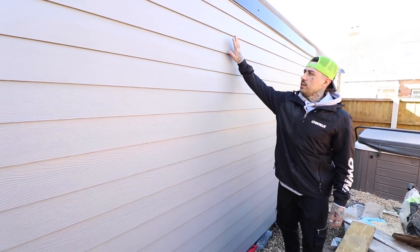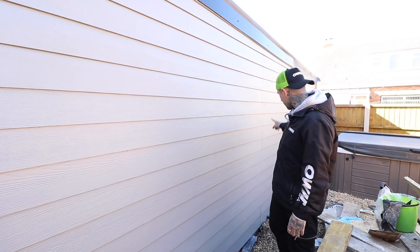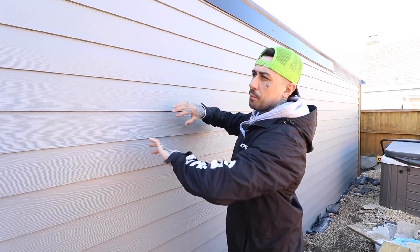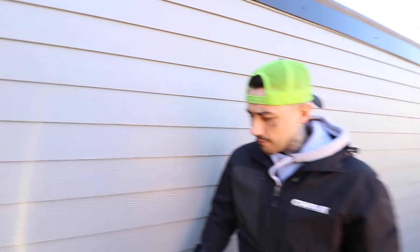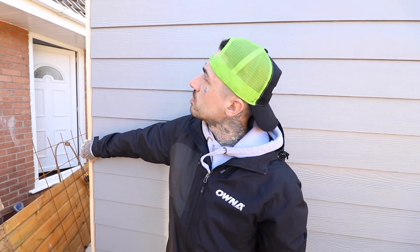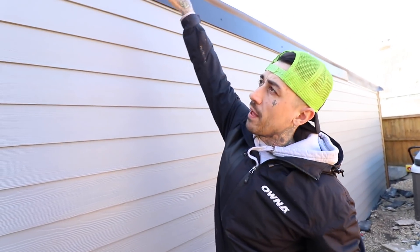So as you can see, the cladding's done and looks pretty sick. I've got a couple of bits to do — I need to run some mastic up that middle joint. A lot of people said staggering the boards would have made it more waterproof, but I'm just going to use mastic on that single joint. I've got a non-treated bit of wood on the front that I need to stain and treat. I've also put UPVC trim all the way along, and then one sheet of EPDM rubber on the roof — I didn't film that day, I just got it done.